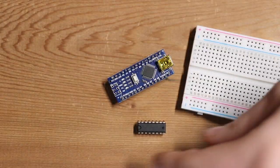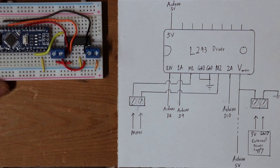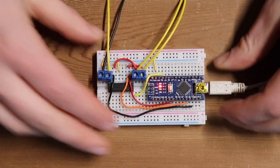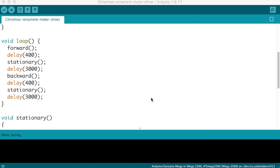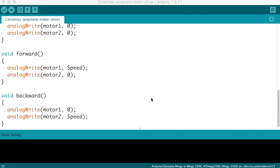In order to slow down the speed of the motors, I'm going to use an Arduino Nano and the L293 motor driver, hooked up as shown in this wiring diagram. I'll go ahead and upload a short sketch to the Arduino, and this is just going to control the speed and direction of the motors. Playing around with different timing and speeds, we can get a very calming mixture or a very violent and aggressive stirring and agitation.